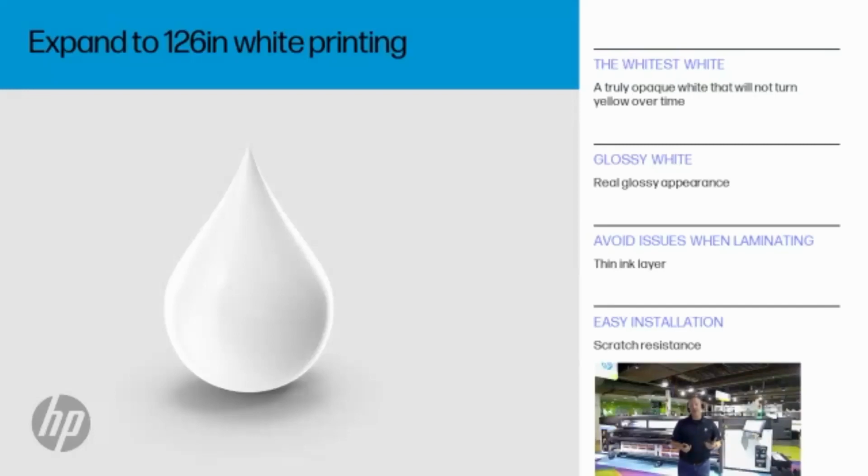The other thing that UV inks suffer from, again, we know because we used to make the same type of printers, is chipping. So when you go to finish a piece and you cut it, a lot of times around the edges, it will be brittle and chip. Again, that's the way UV ink cures. It crystallizes. We can cut our ink. It's a polymer, it cuts like a balloon or a rubber glove. So once it's adhered to the piece, it's not going to separate and pull away, or flake off, or chip off. It stays right where it's put.